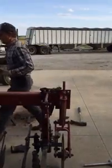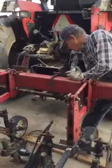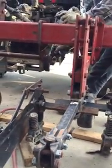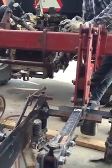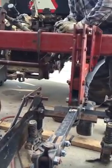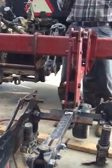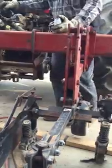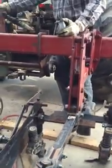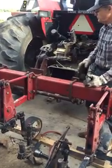Let's see. I would also, if you have time, find washers. I think they're inch, and washer this between the 3-point hitch and the pin. So that's always tight. Not tight, but it keeps your cultivator so that all day long it stays in the same place behind your tractor. Doesn't move over a half inch. Also, you want the right size pin here. I know you just put this in here just to lift it. But get a full inch pin, so that's good and tight.